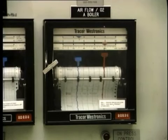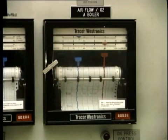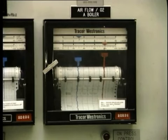Another important parameter that must be measured is the air flow. This refers to total combustion air supplied, primary, secondary, and tertiary where applicable. This measurement of airflow is often used in automatic controls, which ensure that air supply is proportional to fuel. We've looked at temperature readings for the air and gas path, but what about pressure? Certainly the indication of air and gas pressure at different points can be very useful to the operator.